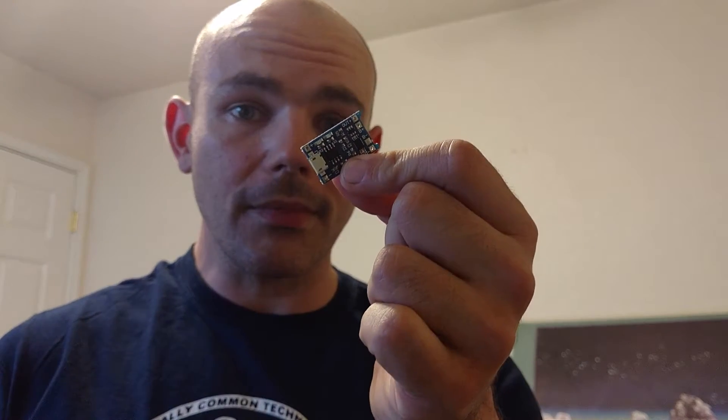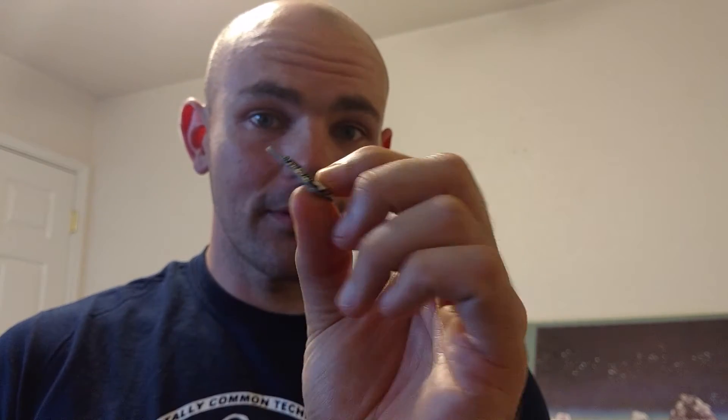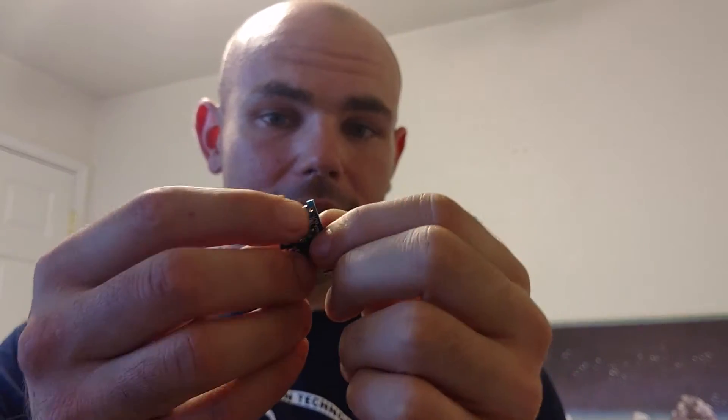So let's get some terminology down. This is a charger — a USB lithium-ion slash lithium-polymer charger. By the way, lithium polymer is a subset of lithium ion. This has a micro USB input connected to the battery on the output. This is also a charger — micro USB, a single chip and a few discrete components, goes to your battery. 18650, lipo, doesn't matter. This thing will charge both of them just fine.